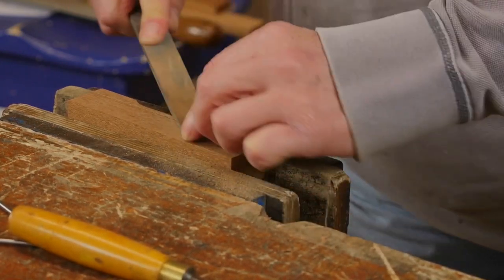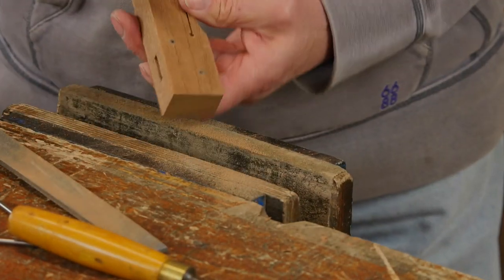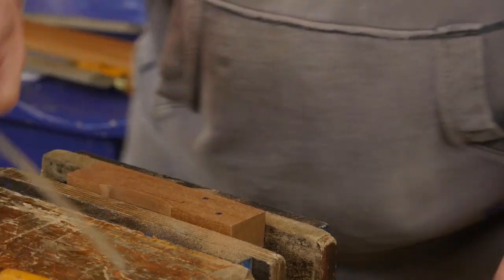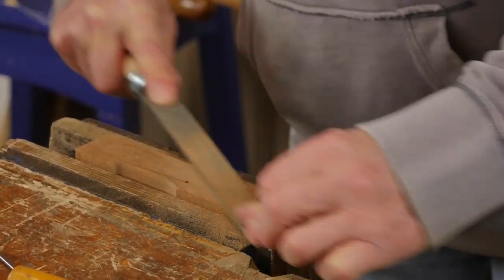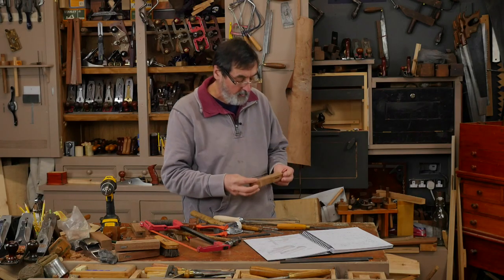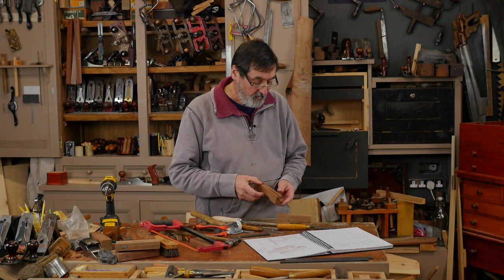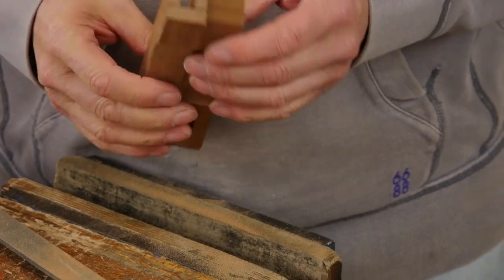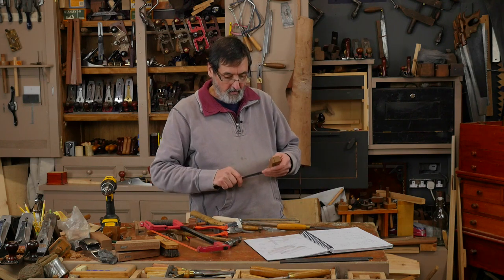You can use a nail if you can get the exact sized holes — the only problem is they can work loose. But look how neat we've got this surface here: nice smooth finish. I'm going to finish this side the same way, a couple of file strokes. There it is — this is the main part now. I've got one virtually finished; we've got to put the mortise slot in here and I'll show you how to do that next. That works perfectly well for my first clamp.